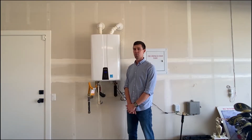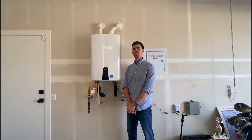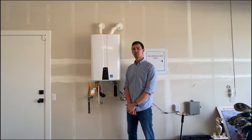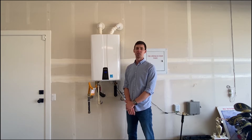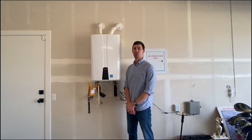Today I'm going to show you the correct way to flush and descale your tankless hot water heater. The reason you want to flush and descale these tankless hot water heaters is because, unlike the traditional tanked hot water heaters, the tankless units have a heat exchanger with much more narrow copper tubing. Because that copper tubing is more narrow, it's more susceptible to calcium and lime scale deposits. Initially, the calcium and lime scale will reduce your efficiency, but ultimately it will lead to complete unit failure. So you really want to make sure that you're flushing and descaling these units on a regular basis.